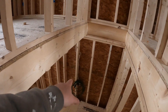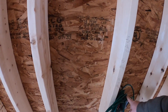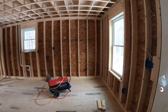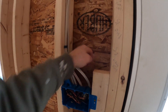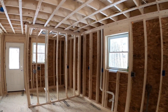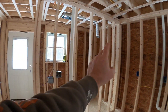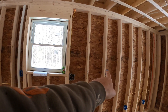Downstairs we have our switches set up to maintain good flow — you can shut off the stairwell switch and turn on the living room switch without backtracking. We've done our three-way switch with a block so spray foam doesn't push it out when they foam the walls. The kitchen box will have a receptacle and a switch for cans over the range, receptacles along the counter, a switch for a can over the sink, and a dedicated refrigerator receptacle.